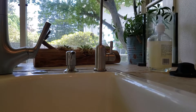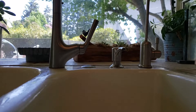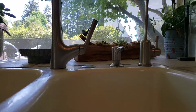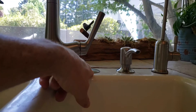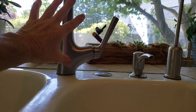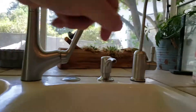Right next to it, a new soap dispenser came with the Kohler faucet. It went back into that hole because if you try and mount it right next to the Kohler faucet, there's a conflict with the lever. Originally, that is where the soap dispenser was with the old faucet — it was a different configuration with a separate hot and cold handle and spout. Now it's all integrated into one piece. So: all one piece here, sinkhole cover, soap dispenser, and then the existing RO faucet — it's all tied back in.